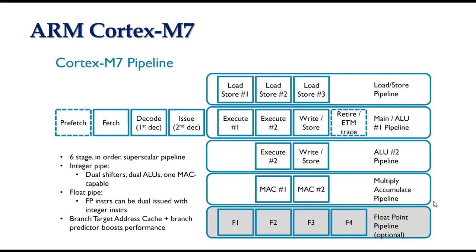The prefetch unit provides 64-bit instruction fetch bandwidth and a 4x64-bit prefetch queue to decouple instruction prefetch from the DPU pipeline operation. It also provides a Branch Target Address Cache (BTAC) for single-cycle turnaround for branch predictor state and target address, and a static branch predictor when no BTAC is specified. It also provides forwarding of flags for early resolution of direct branches in the decoder and first execution stage of the processor pipeline.